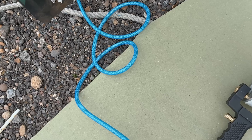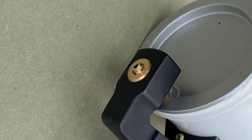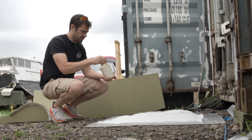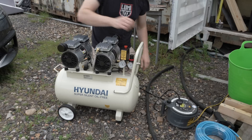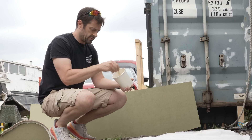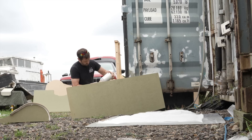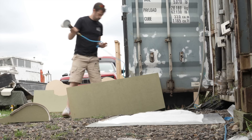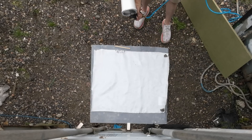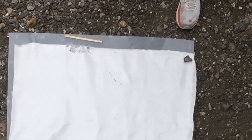The whole point behind the spray process is I want to have a better, richer fabric ratio than you would get through a normal squeegeeing or rollering wetlay. All the components fit together very tightly, which is better than loose — but getting the nozzle through the gun slot needs a lot of effort. I was thinking it would be hypothetically good to have a spare spray setup ready to go in case of equipment failure. I mix the resin up with the catalyst. It's not a hot day, so the pot life is no major concern. We're going to wet out about three quarters of a square metre of single-ply glass fibre. I wasn't expecting perfection on attempt one, and obviously it takes a little time for resin to flow. Without pigment, it's hard to see, especially at the lowest flow setting. And then... drips.